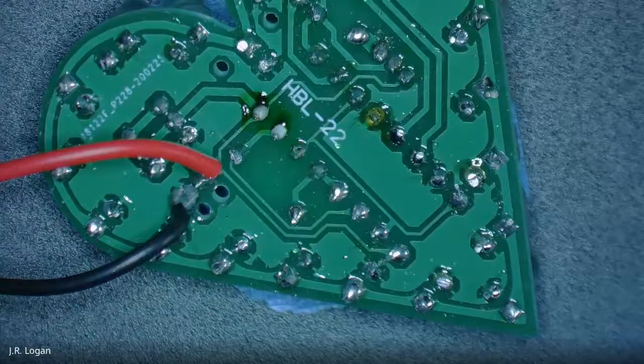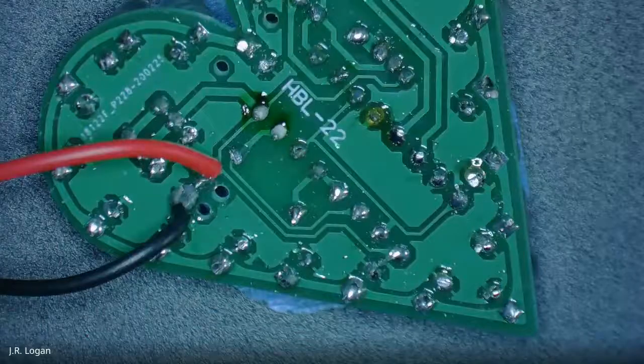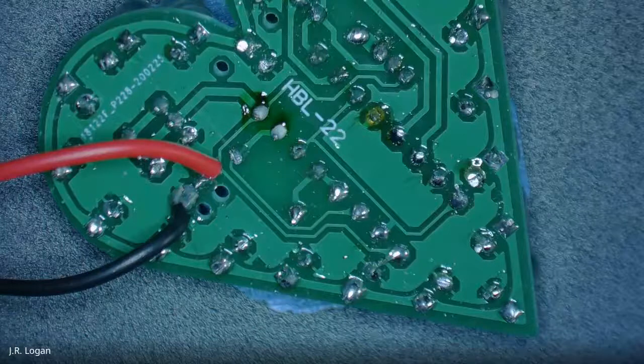Where do you put the leads in on the multimeter? Which ones go in which way? Yeah, so it changes based on the function, and it should be, I think, the first two. The terminal A10 max and the other one, because the other one is COM. So one and three? What's that? One and three? I think it's one and two. Okay. But what I would do is put them in those two, go to the continuity setting, and then see if it beeps at you. And if it doesn't beep, try the other one.